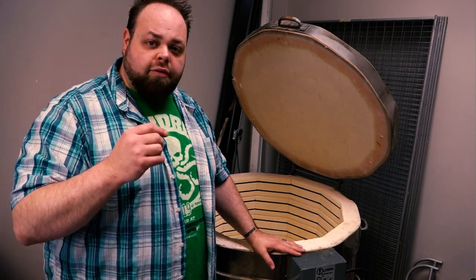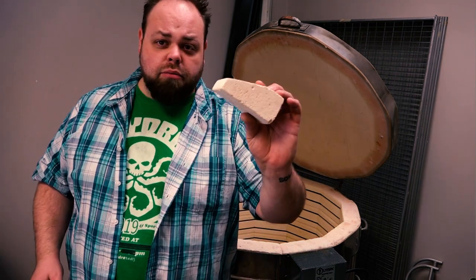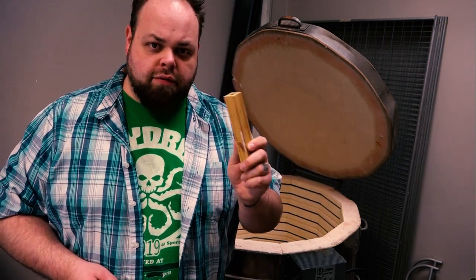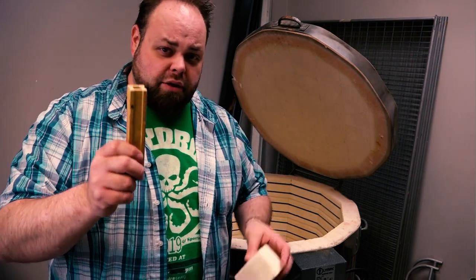There are two types of bricks used in kilns. You have the traditional kiln brick and then you have a refractory brick. The big difference you can tell between the two: a kiln brick is super light — like air in my hand. A refractory brick is kind of the same substance as the posts that hold up the kiln shelves. It's heavy and thick. Notice the different sound — how much thicker and denser this material is.